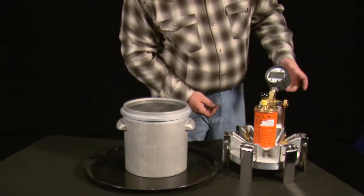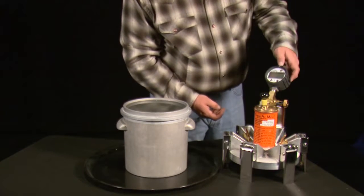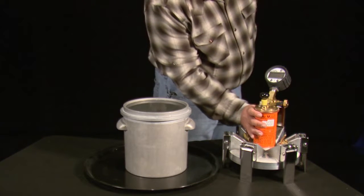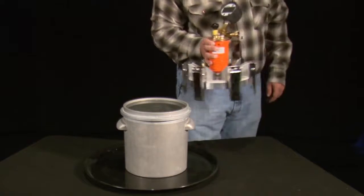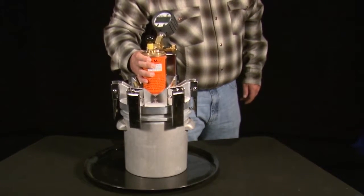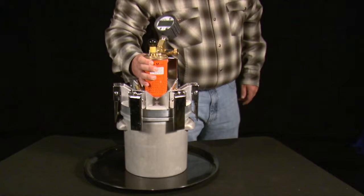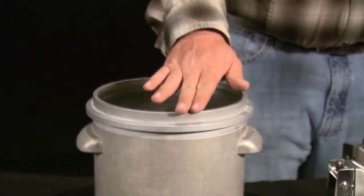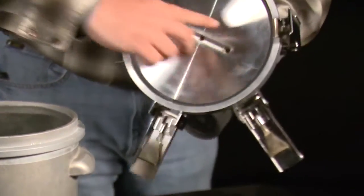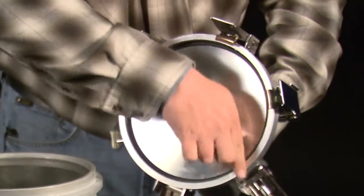At this point, it should display 'press enter to begin SAM test.' Fill and consolidate the unit weight bucket with concrete the same as you would a Type B — in three equal lifts with 25 rods each lift. After the unit weight bucket is full, attach the lid. It is extremely important to clean the rim of the unit weight bucket and the O-ring of the SAM lid extremely well before tightening down the lid.